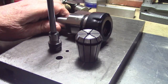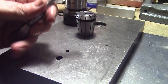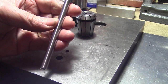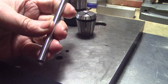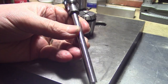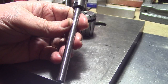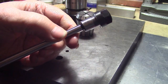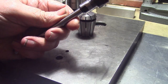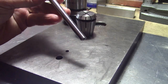The beauty of these is they are straight shanked. They come in different sizes — I'm using an eight millimeter diameter shank. This is the shortest shank you can get: one hundred millimeters. You can get these in 100, 150, and 200 millimeters, and they range from about six millimeters diameter up to 19 millimeters.